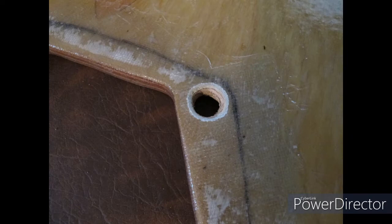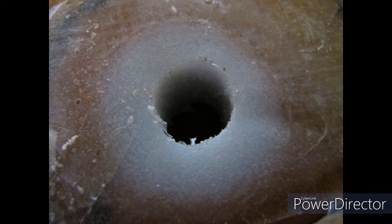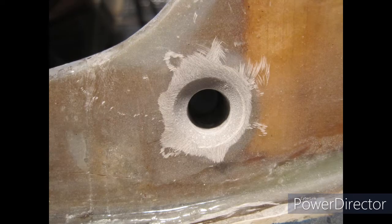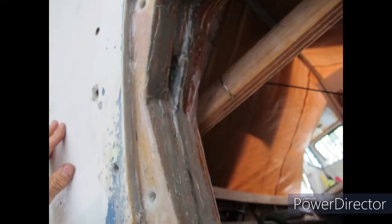As you can see, there's some holes where all the transom bolts bolt through. What you do is you drill those holes oversize, fill them with thickened epoxy, and once they cure, you drill the appropriate sized hole. That creates a sleeve or an annulus in there so water can never penetrate into the plywood. You chamfer it, make it so it's got a little recessed area, then you put O-rings in there, and that squeezes in between the bolts, the transom plate, and the transom itself, creating a watertight seal.